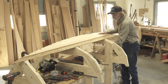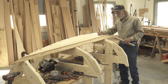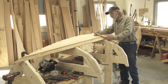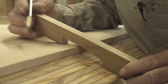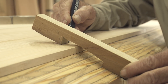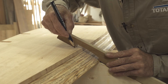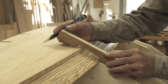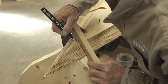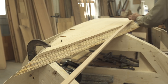Now I need to plane this back and knock it off on a nice angle, and I want to make sure I don't go too far. I need a line up there just to guide myself, so I've got a little gauge like I made before. I'm going to apply it to the center section and transfer the mark from the corner of the marking gauge onto the bottom — on the back side as well, then move forward and do the one up front. There's no fancy tool for this; cutting it from a scrap piece of wood is exactly what you need. That line is very important — I want it on there in the right place because I'm going to sneak up on it fast with an electric plane.